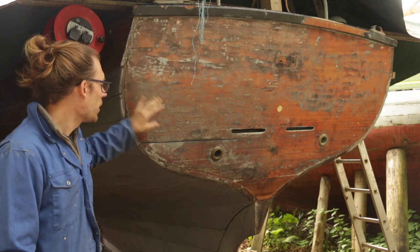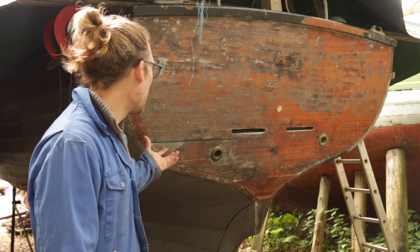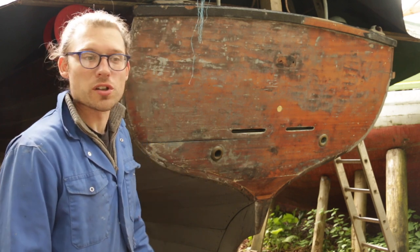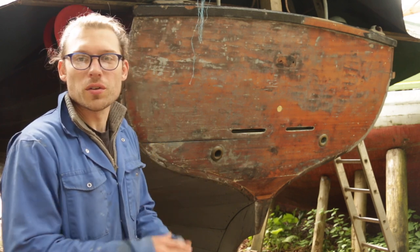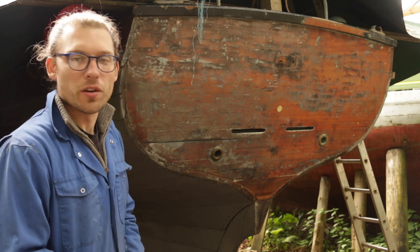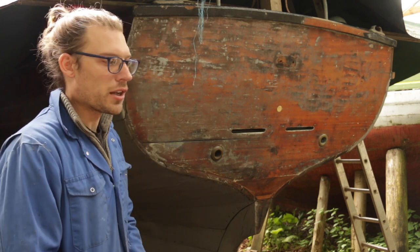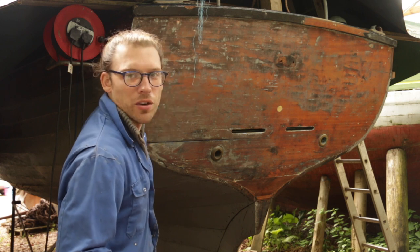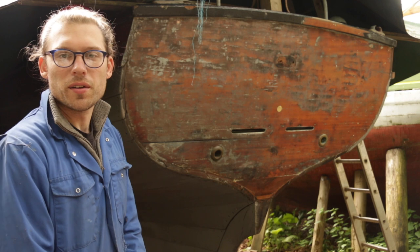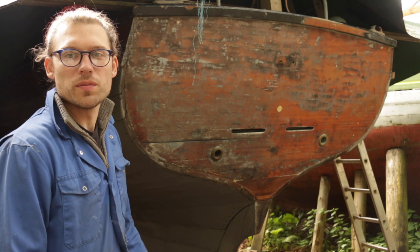It's more or less ready to be primed. It's just a little bit sticky down here where I've put some raw linseed oil on it, and it doesn't want to take any more oil, so that oil has just come to the surface which is a good sign. What I need to do is bring down some thinners, clean that all up, and then give it a coat of primer. That will show up all of the little imperfections, which will allow me to flatten that off with some compound wherever needed, sand it, then prime it and paint it. So it's good that the transom is almost done.